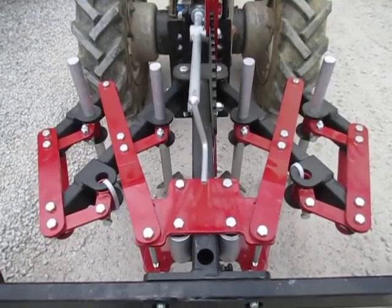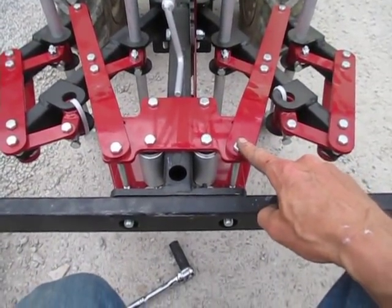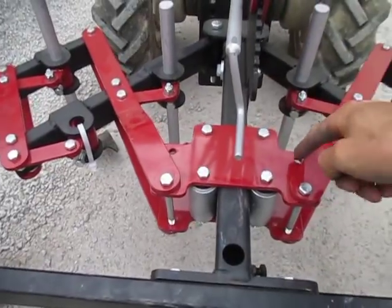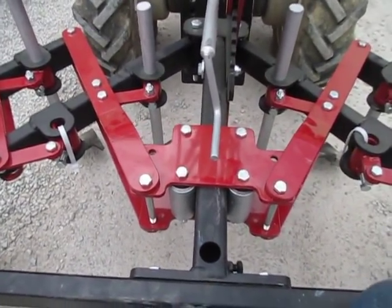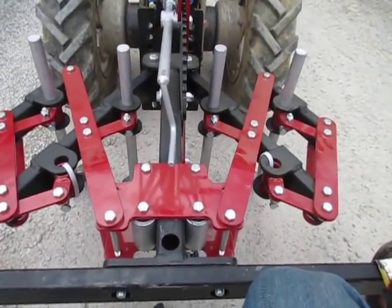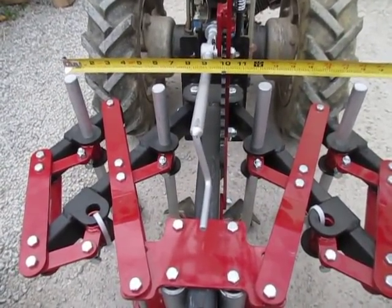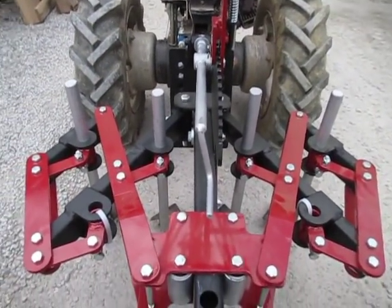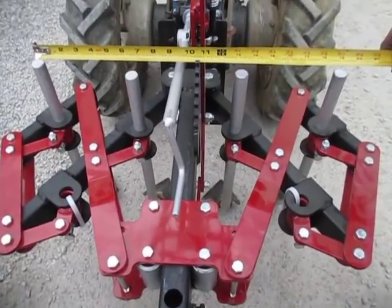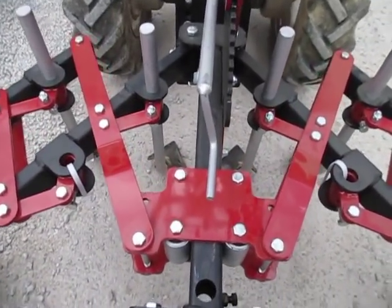In this section of the video, I'm going to show how to adjust the frame to achieve a little wider width. Right now, these bolts are located in their rear hole. The front hole can be seen — if I crank this open, you can see this extra hole on either side. In this position we can achieve the narrowest adjustment. I mentioned there were 10 adjustment positions — there are actually 12. Right now our shank-to-shank measurement is about 18 and a half inches center to center. Each notch gains about one inch of overall width, so the shanks are moving apart about a quarter inch per notch.